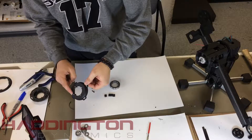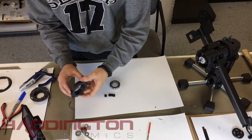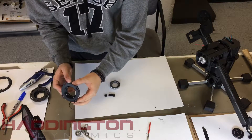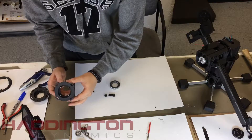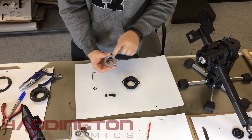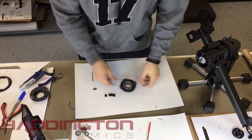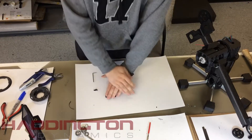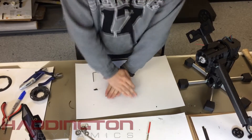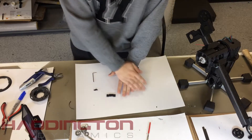When the arm body is secured, it is time to attach the stator gear for the harmonic drive. Put four M2 by 16 millimeter bolts into the bottom of the stator holder, as the posts around them are very fragile. The stator gear has four smaller holes through it and two of them opposite to each other have thread on one side. Find these holes and place the stator gear thread side down into the stator holder, matching them up with the holes in the bottom. The stator gear should sit about a millimeter below the top of the stator holder.